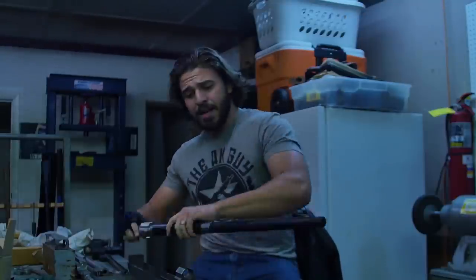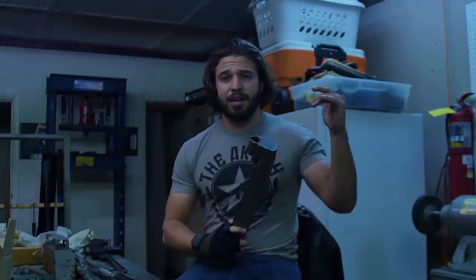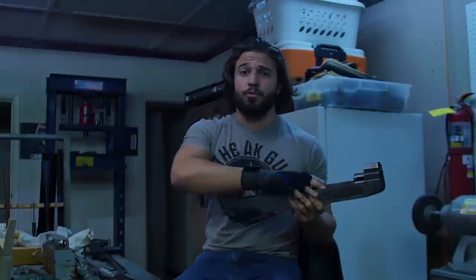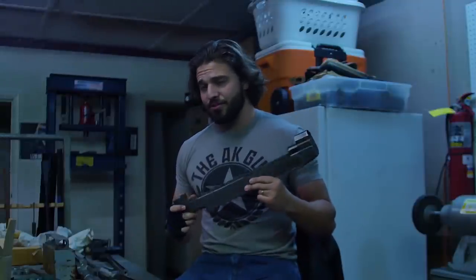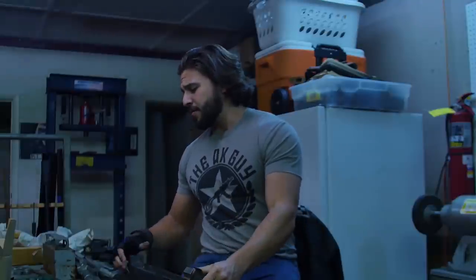The bolt is going to come in and twist and lock on that triangular lug right there. So none of the interlocking parts that actually contain the explosion of the gun are going to be cast. There's so little stress on the AK-50 receiver because all it does is hold the fire control group, hold the magazine, hold that barrel extension in place with a pin through the side, and provide a rail for the bolt carrier to slide on. We were thinking we might even be able to make this out of aluminum eventually - there's really not a whole lot of stress on this, nothing compared to a normal AK receiver.